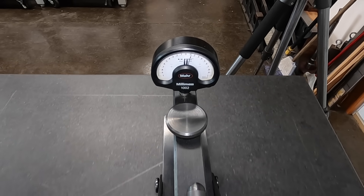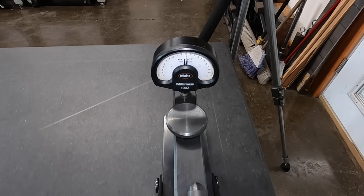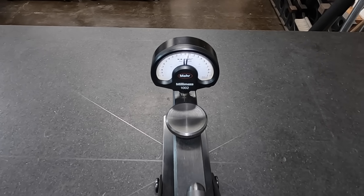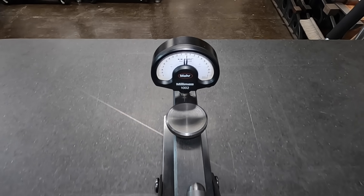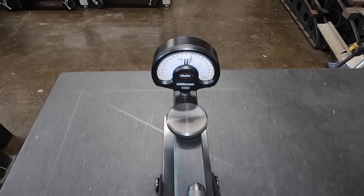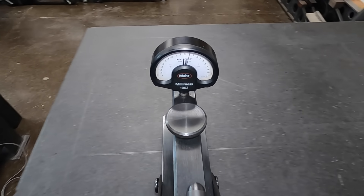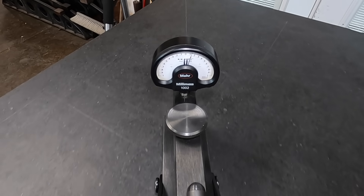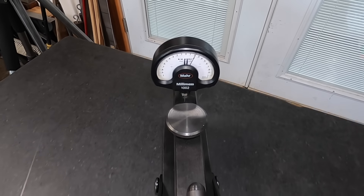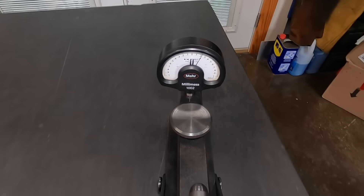Off camera, Adam and I were talking about this repeatometer — people, it's not as simple to use as you might think, because we're constantly going over areas that were traversed with the base or with the tip, and it's simultaneously referencing all three contact points. So you have to be very mindful of a 3D image in your head when you're using this, because you can mistake a high spot as you're traversing over a low spot in the middle of the meter. We're going for 70 millionths.